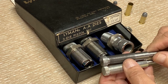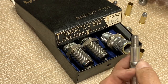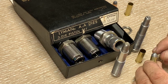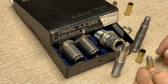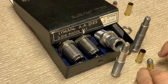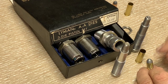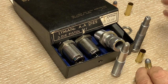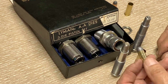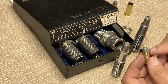A lot of you aren't into machining and I'm not going to bore you with that until the end. What I do want to talk about is what you're going to need in order to build this round. It's a little more complicated than you think, and I'm not going to cover the projectile this time — only the actual setup. These dies turned out to be kind of a disappointment. I'd date them from about 1961 or 1960. They don't have a roll crimp feature built in, so that's something to think about. This round needs a little bit of roll crimp, so I think I can cheat a little and use the 38 Special dies I have to get a little roll in there.